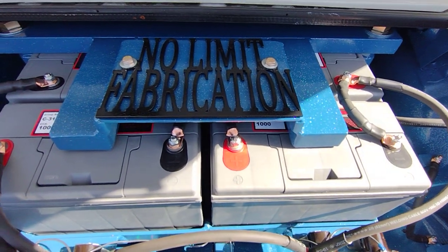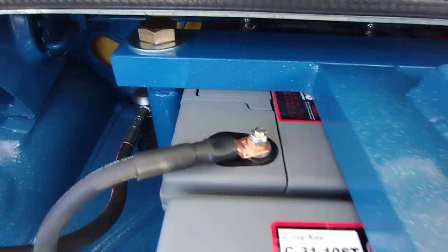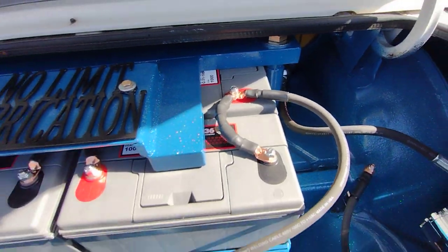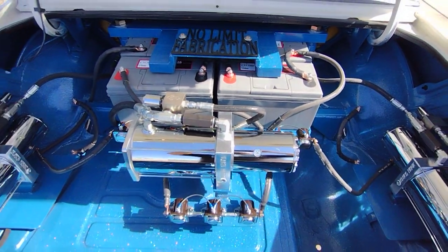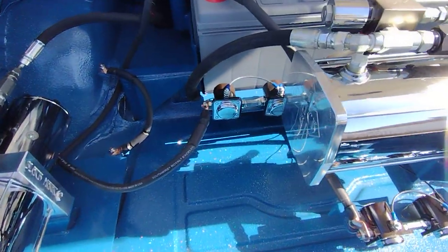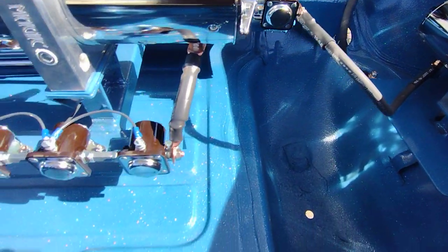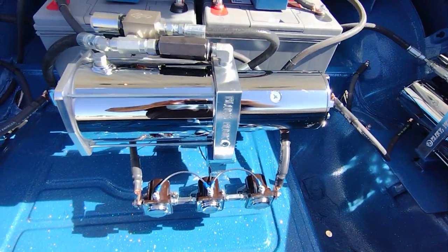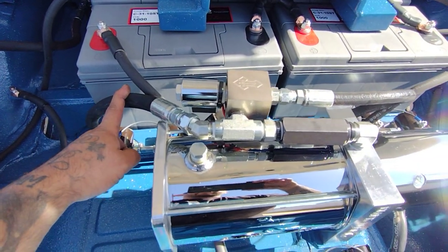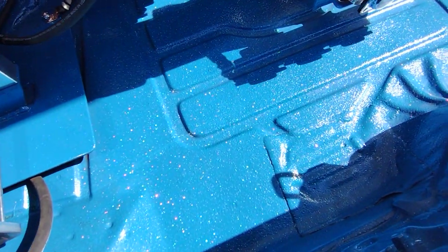All under tight — Great Top 1000s. No-limit built baby, she was a virgin. Got those big dog bolts tucked away, tying down all six of the batteries. There she is — three pump setup, six batteries. Got two solenoids for the rear pump, another two solenoids for the other rear pump, three solenoids for the nose. That's your front pump right there. Got the single number eight running to the nose, split underneath with the Y block in the engine bay.